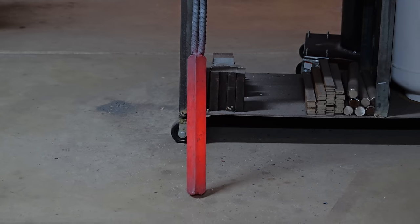The final step for this pattern is one more four-way weld. Because this is the final forge weld, I'm taking a little extra care — I'm running a weld bead around the entire billet rather than just the sides. This means I'll have to grind it off later, but it'll ensure I get perfect forge welds. I didn't set this with the squaring dies since I welded around the entire billet, so I'm just using the big flat dies. After two or three heats of gentle drawing out, I use an angle grinder to grind out all the MIG weld. Because Chinese cleavers are known for how wide they are, I need to make sure this billet is very rectangular — around two and a half inches wide by one and a half inches thick. Then I let it cool down slowly overnight in a bucket of vermiculite to make sure it is super soft and ready to be cut into tiles.